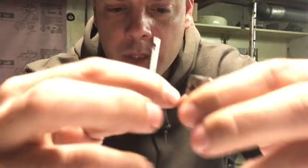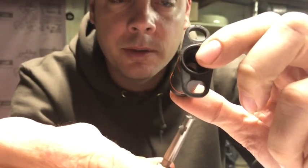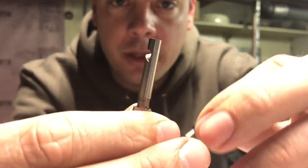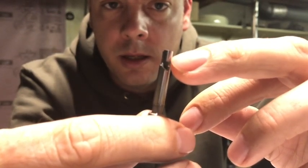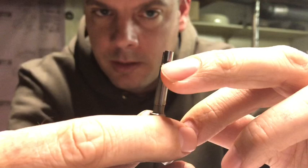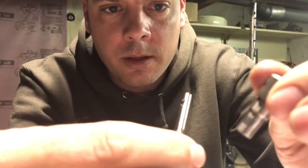When you try to get more fuel out of these, what you do is you turn the barrel, which sits in the barrel holder. From the top of the injection pump there are two screws that hold it to the pump housing. When you turn it, there is what's called a helix and a vertical groove on your plunger. As you turn it, you're able to get to a point where the helix cut is turned further, giving it more time to compress the fuel before it reaches the spill port — which is underneath the helix. Then it returns the fuel back through the spill port and stops the compression.